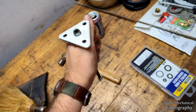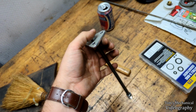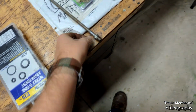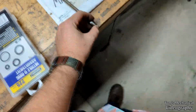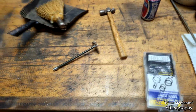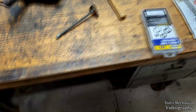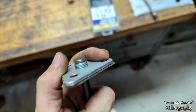That'll seal to the top of the tank, and then I just have to make sure that this seals to whatever's up here, this guy. So, I need to get this flange to seal to this flare nut, and then that bolt to this, and it'll be airtight. I mean, theoretically, hopefully, ideally. The only thing is, this can slide.